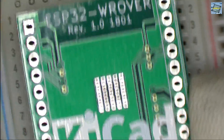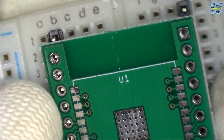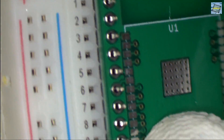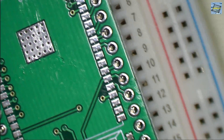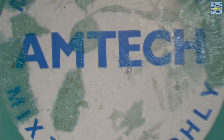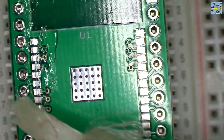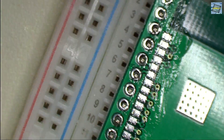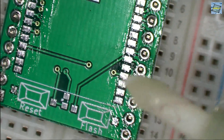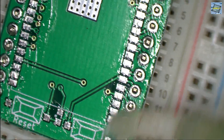I'm using a breadboard and pin headers to align the small PCB board on the breadboard, so everything stays in place while I'm soldering the adapter. Next, I use a flux pen — this pen is usually used for liquid flux, but I use the Amtec semi-liquid flux to apply to the pads on the breadboard, so everything is heavily fluxed before I use any solder.